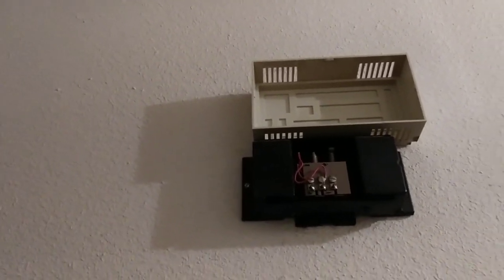Breakers aren't always labeled great — like in this house they definitely weren't. It took me forever to figure out what the story was. The fridge, lights and plugs, kitchen plugs, disposal, washer, dishwasher, LTP, kit place. It turns out it's number nine there — LTP, lights on the front porch I guess. I have to switch number nine off before I do the install. Just warning you, it may not be clearly labeled properly if you live in an older place.